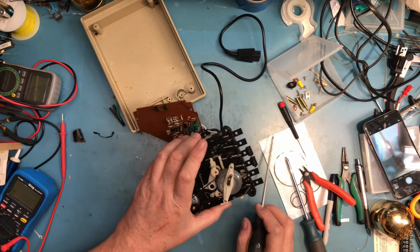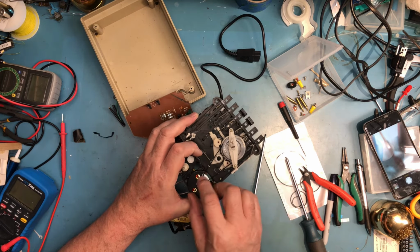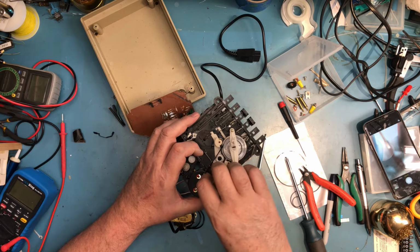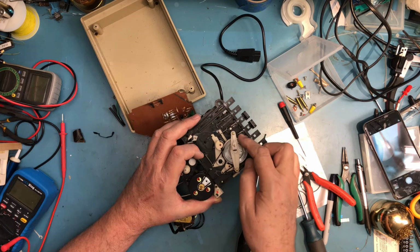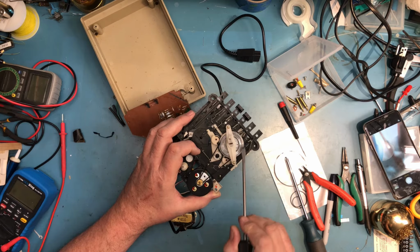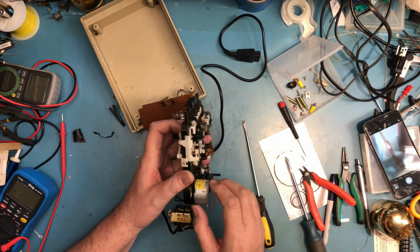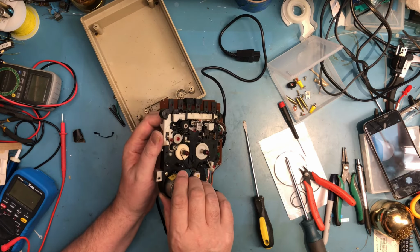potentially off. So for those of you who don't understand a cassette mechanism, haven't been inside of one, there's of course the DC drive motor here, and this is the drive motor that basically drives the entire system. That belt is fairly loose. The capstan feels really tight. It may need to be lubricated. This belt drives a flywheel here that you can see, this large metal flywheel. That flywheel becomes this post right here. And so when I spin the flywheel, that post will spin. You probably can't see it, but it does.